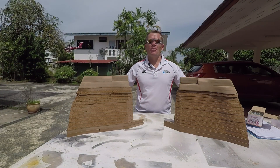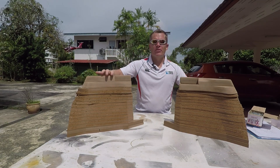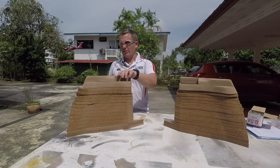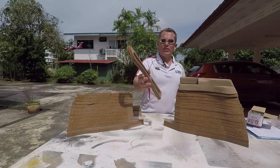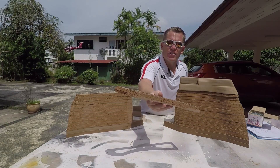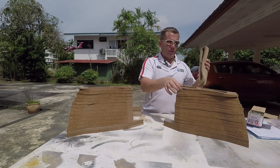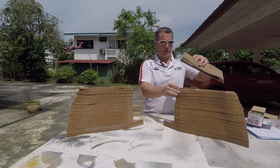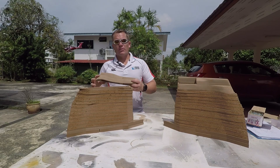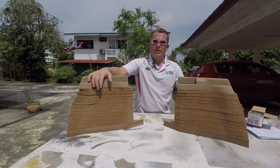It's been two weeks since I started cutting these on the CNC, and if you've been following on Facebook you probably know I had a problem with the Z axis on the CNC machine, which created a lot of problems. It started to create cuts that were very rough on the edges — a bit of a disaster. That's going to take a lot more sanding than normal, which would usually turn out very smooth with just very faint lines on each piece. So it's now time to assemble these, countersink each hole, put them together with screws, and then sand them into a shape that will fit the MIP.